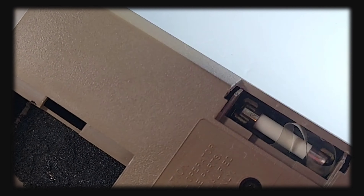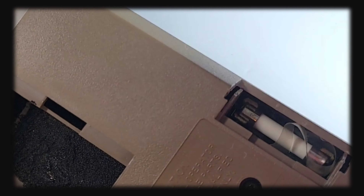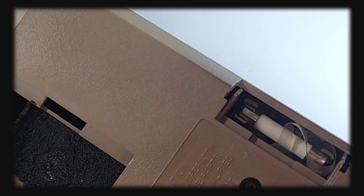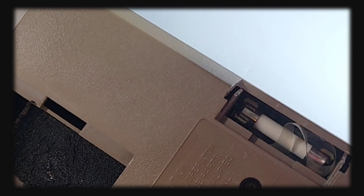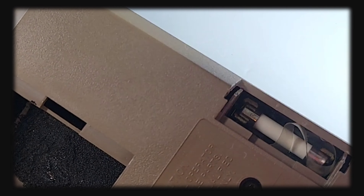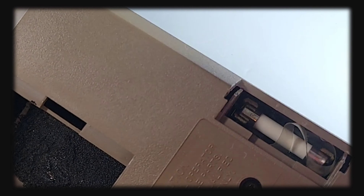Calibration pot R103: apply plus 190 millivolts to the 130A and a display reading of 190 plus or minus one digit — this is the only adjustment needed to calibrate this instrument. Calibration should be performed every two years. Cool — that calibration pot is in there; we're going to take this apart and get a closer look.